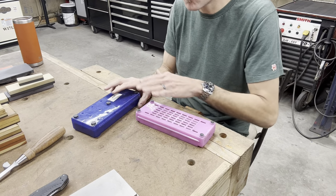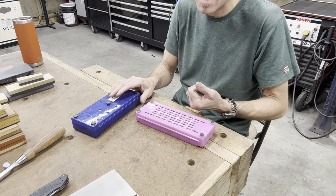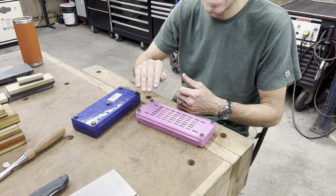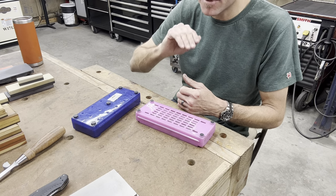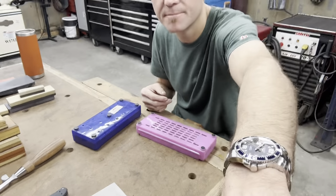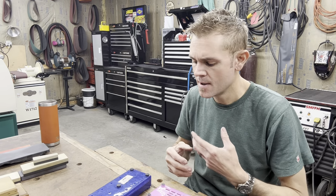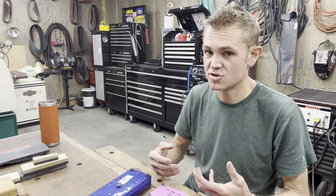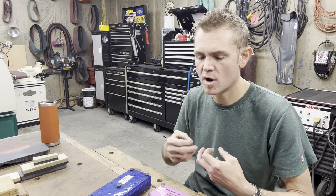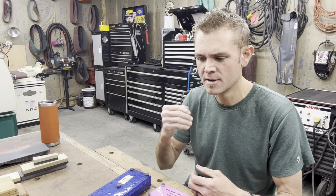They do make a really good edge for cutting wood, and there's no doubt about that, because what works best when cutting wood is an aggressive, toothy edge. Something that's very slicey. An edge that would work very well on a straight razor is not really the same edge that would work really well on a cutting tool, because you want it to be a little more aggressive for a tool to really slice through those wood fibers, almost a little bit toothy.